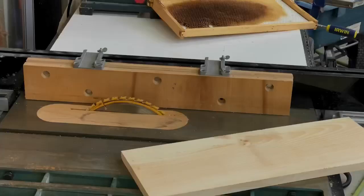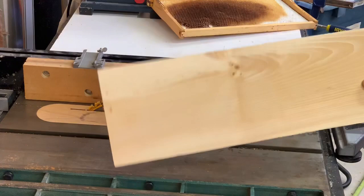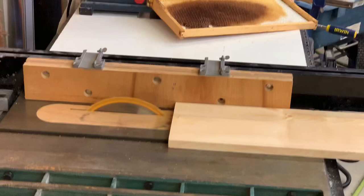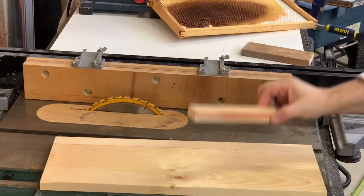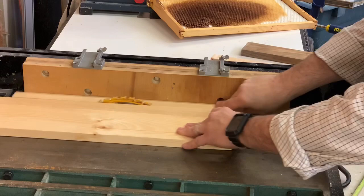Back at the table saw, we're trimming down the roof pieces. You want about a one-inch gap. We're going to rip that final board into two strips, plus a third strip, which will leave a small piece remaining. Be careful ripping narrow strips because they can kick back. We'll then cut our side rails from these pieces.